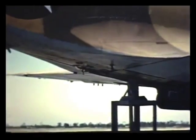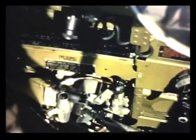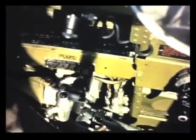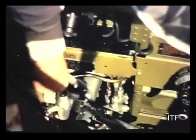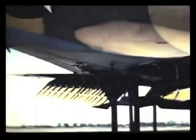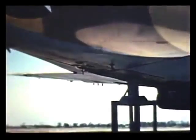Are the flaps automatically locked in position? Yes — simply release the trigger to stop them. They will stay in that position as long as the selector is down. To lock them permanently, move the control back to neutral. And I suppose the flaps up position is back here. Yes, that's right. To raise the flaps, you move the control back and pull the trigger on the stick. The flaps go up pretty fast — once started up, they continue to move closed.